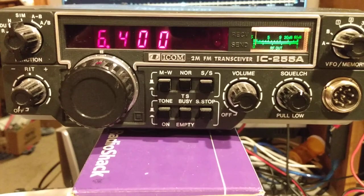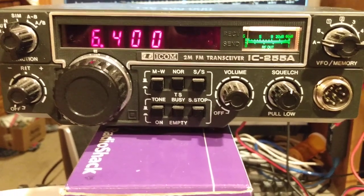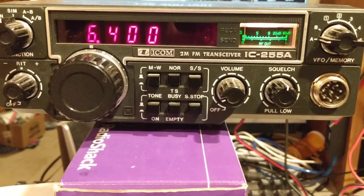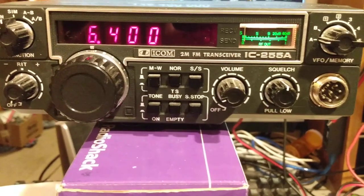This particular radio was a little bit of a hassle because it is the only one in the family that is FM only — it doesn't have sideband. I was sending out a 100 Hz byte to every other radio, and this one chokes on it because it only goes in 5 kHz steps.